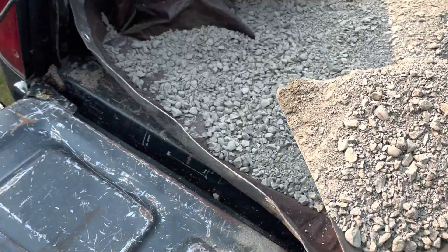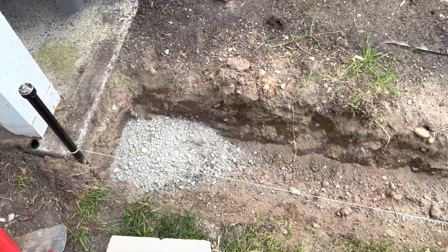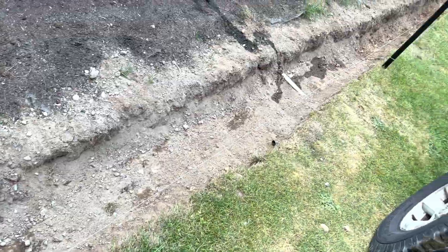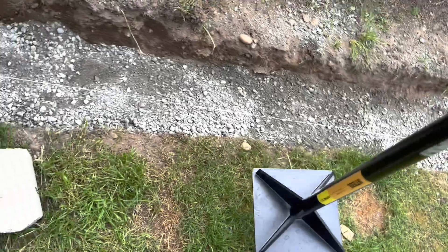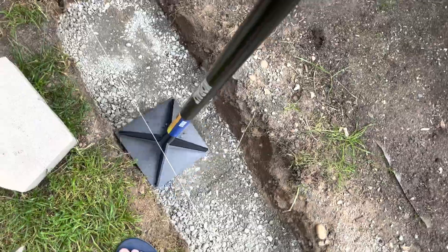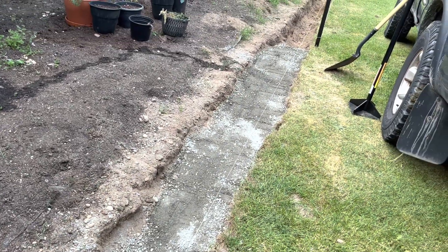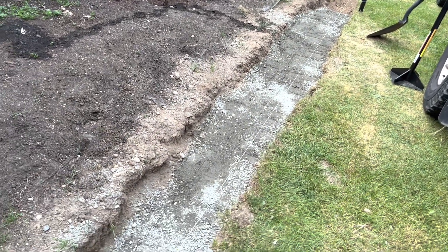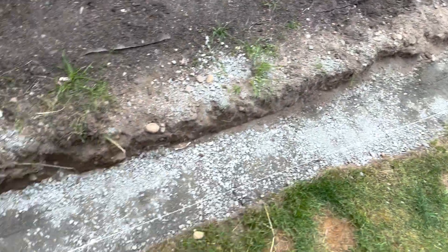If you're close to your trench, do this by shovel; otherwise use buckets. Put it all the way along here and pack it down. I've got my base in there and tamped it all down. Now it's packed all the way down to that point — the same distance from the top of the pack up to my level line.